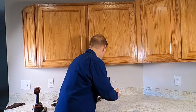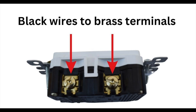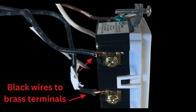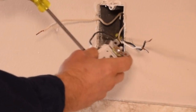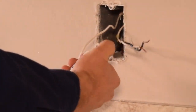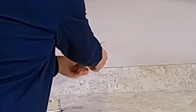Let's get this hooked back up. I'll start with the lines. It matters left and right as well as top and bottom — brass gets the black wire, white gets the white wire. When you're done, there should be a black and a black on one side and two whites on the other. Take your time, there's no race here. Make sure when you tighten these screws down you really tighten them — they can fool you into thinking you have a good grip only to have the wire pop out later. Use a flathead screwdriver to get in that straight groove and really crank it down.